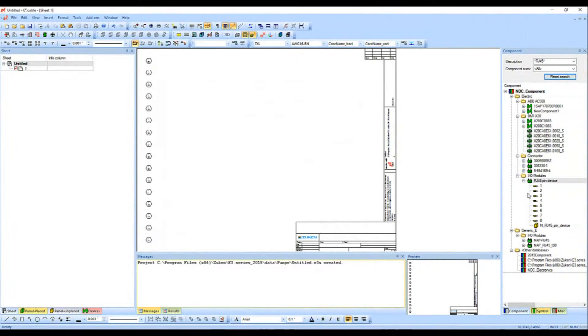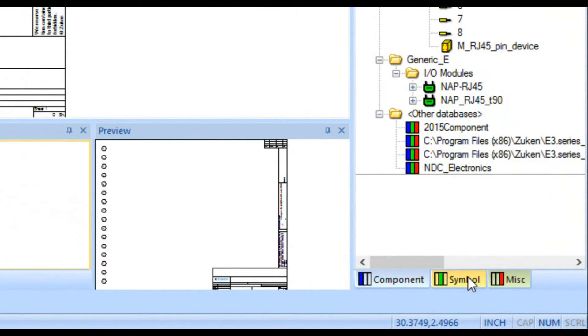One other thing I'll mention is that they treat components and symbols in a very special way, which is different from most of us working on the PCB side. Symbols are just representations — graphics along with some attributes. Think of a resistor on the PCB side: you draw it out and add value, tolerance, and wattage — that's just a generic representation. Whereas in the component, you point to that resistor symbol and say you have most of what I need, but in addition my component is going to represent the manufacturer's name and part number. So it's a great reuse of your symbols within your components.